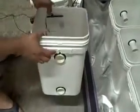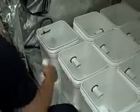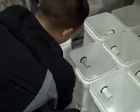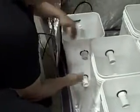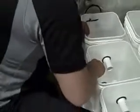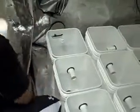Now, what we're first going to do is take our bottom sight and put it right in here where it's supposed to go. And we've got our two fittings, our smaller top one and our longer bottom one, and we're going to install those. Just like we did with all the other ones, we put the bottom one in at the bottom, the top one in at the top. Again, making sure there's Teflon tape on it. We just press it in a little bit with our hand, take it to the last sight in the circuit. Again, how we talked about before, you just squeeze them together, just like that. It's assembled and it's water sealed. It's that easy.